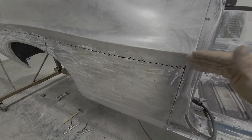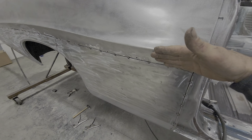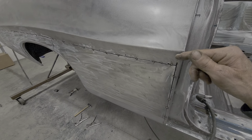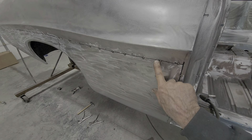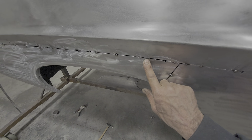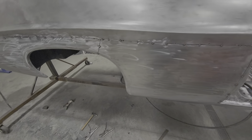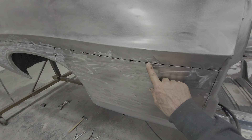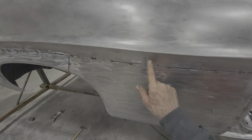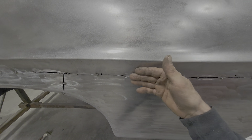You grind three to four inches only, cut with your grinder at a nice angle, right on the top of your new panel. That leaves you with a pretty tight fitting seam. Some of mine are not so tight in a few areas, but mainly I got it going pretty good. I was then able to grind six inches, weld at three — it basically naturally wants to sit level at that point. Grind six, weld at three, grind another six. In between, I'm taking my surfacer and cleaning so that I have a good spot to weld.